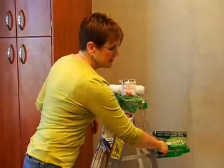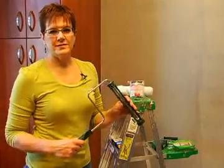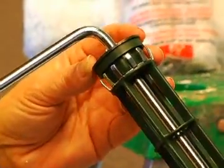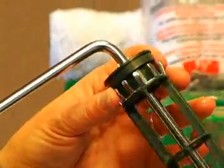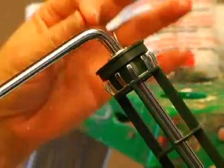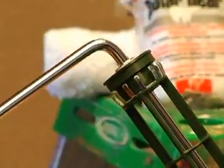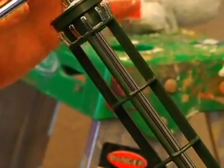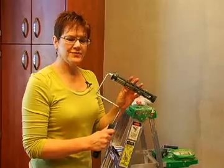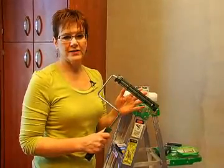I'll also be using the Sherlock Roller Handle. This is a great handle — it has a ball bearing mechanism which allows for easy, smooth rolling of your paint product. Most roller handles have a pin mechanism with just a roller cage, and occasionally your paint product will get down into that pin mechanism and cause your roller cover to slide instead of rolling smoothly across the wall.